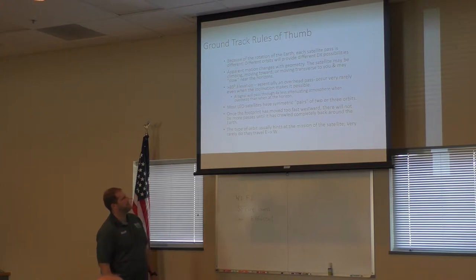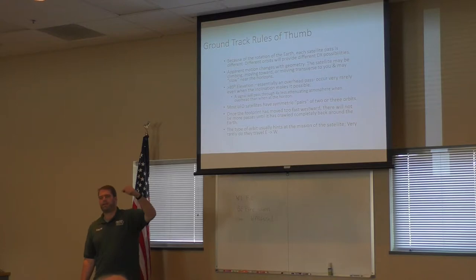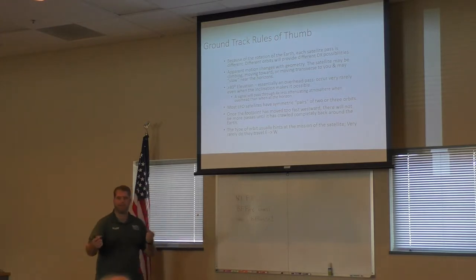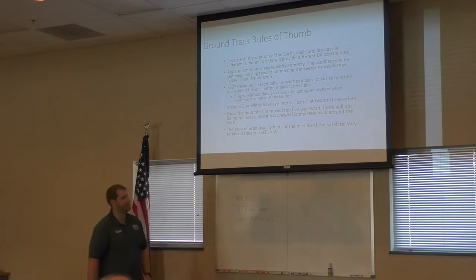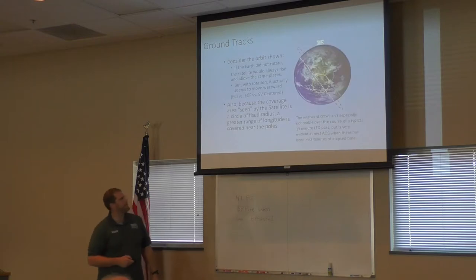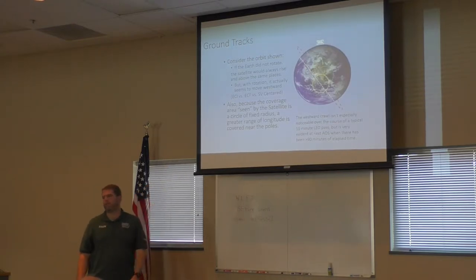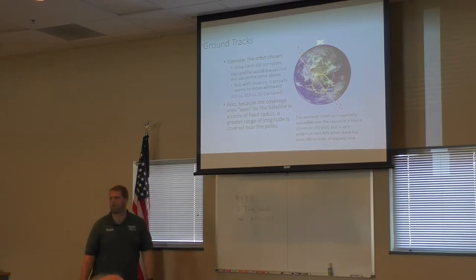I think I mentioned the attenuation, but another thing that is interesting is if you've got a satellite that has a good pass and you see it coming from the north to the south, realize that about 12 hours later we're on the other side of the Earth and things haven't changed all that much. You'll usually get a nice north to south pass, symmetric, with that satellite pass. And then on some of these satellites, such as this, where the footprint finally wanders off of the continent, it might be a week or two before those satellites are starting to come back over at the time of day that you want to work them again. So kind of a unique challenge.